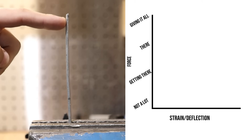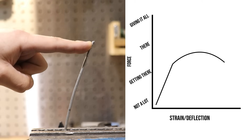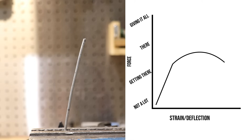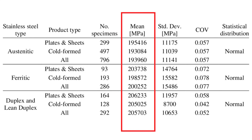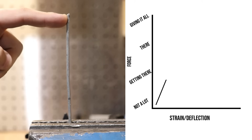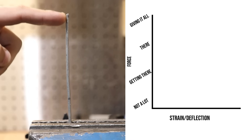However, if I start to push it more and give it all that I can, it starts to permanently bend. This is what is known as plastic deformation — the material won't spring back to its original position. The slope of that straight line represents the stiffness of the material — how much force you need to get it to bend a certain amount. In a textbook or a data sheet, you might see it defined as Young's modulus, usually represented in units of gigapascals. For example, most steel is around about 200 gigapascals, and a lot of cast iron is about 150.